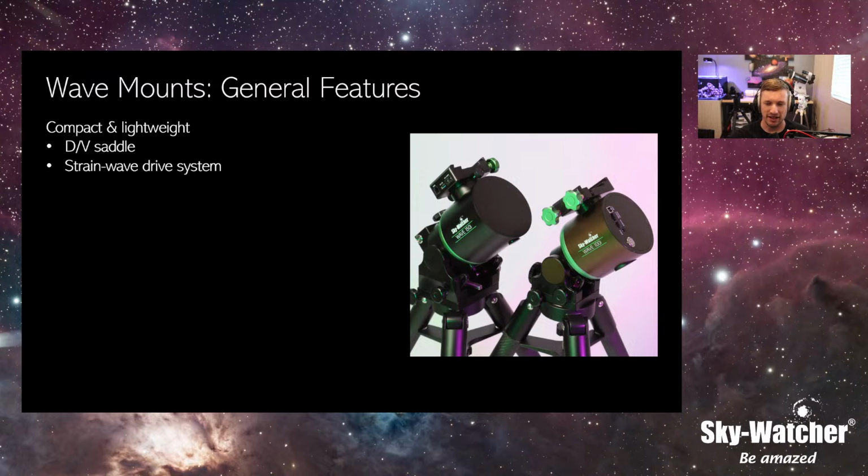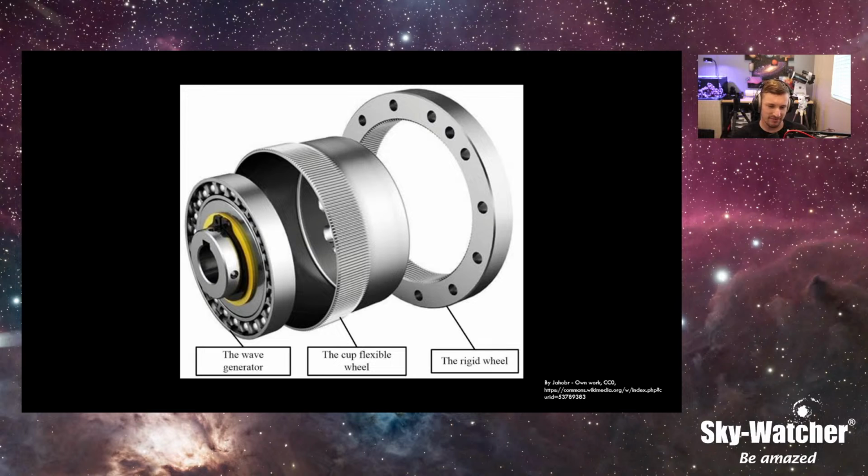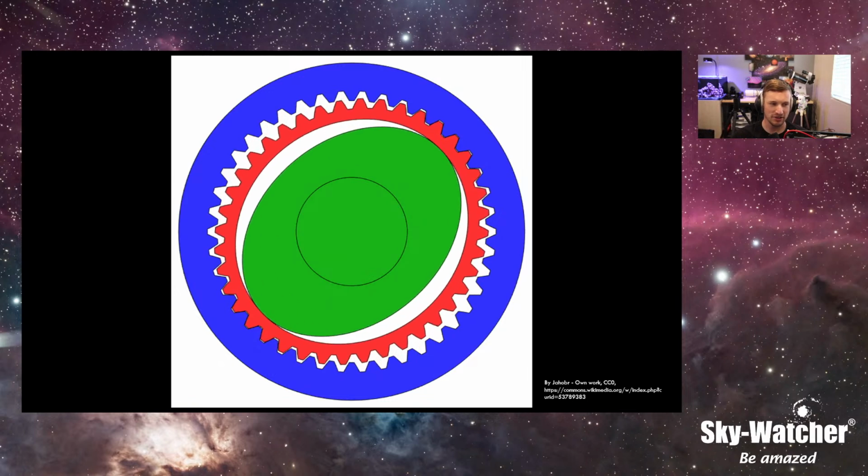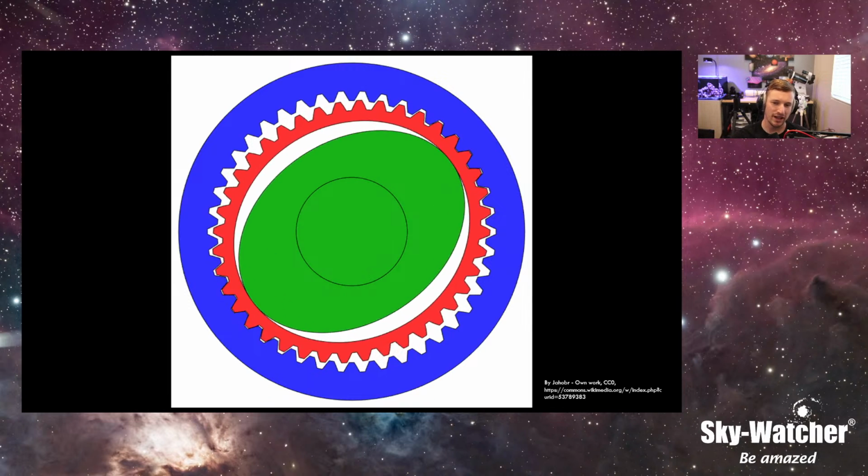So pretty similar there. If you're not familiar with what a strain wave gear assembly looks like, this is a strain wave. Usually you would have a motor. You can do these in a couple different ways. The way ours is set up is we have a stepper motor with a belt, and then the belt goes up to the wave generator, what you see right here, which is kind of the gear assembly. That sits inside what's called a flexible spline, which is bendable. And then that has teeth on it, and the teeth engage into the wheel here. And it looks something like this. Just got this off of Wikipedia, but that shows you basically how a strain wave system works. You have the wave generator in the middle.